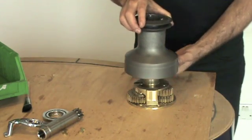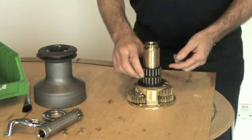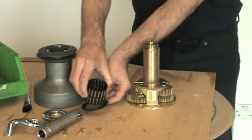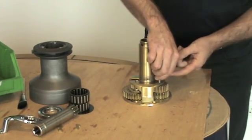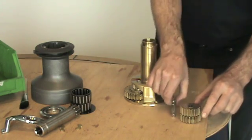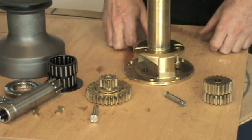These collets are holding in the centre spindle and are located in the screw in the centre spindle when reassembling. Remove the drum. Remove the two bearings and the lower washer. Then we're going to remove the gear stacks by removing this pin and this spindle here.